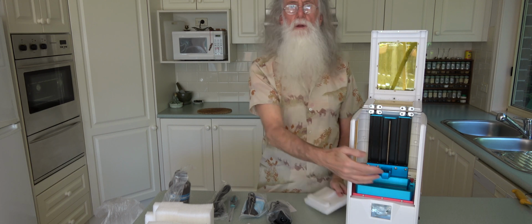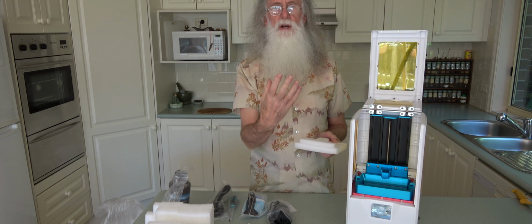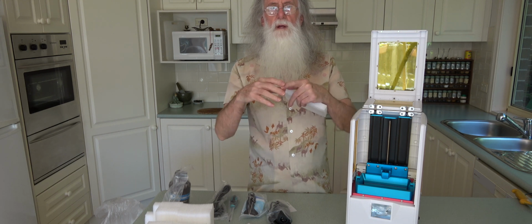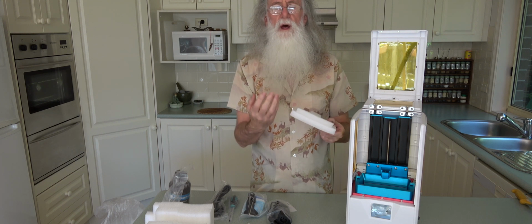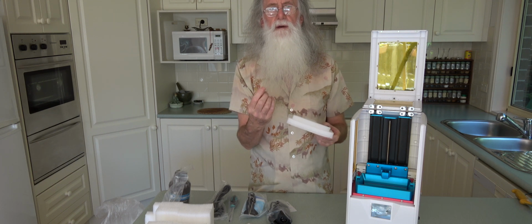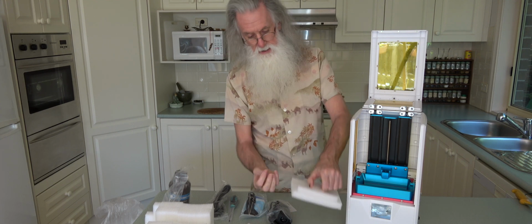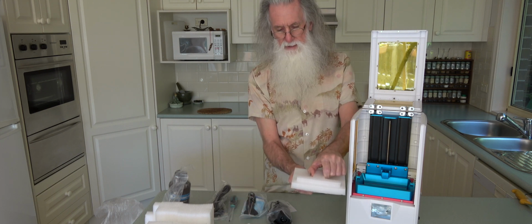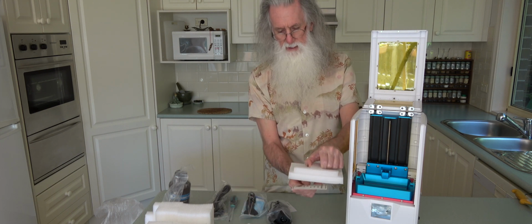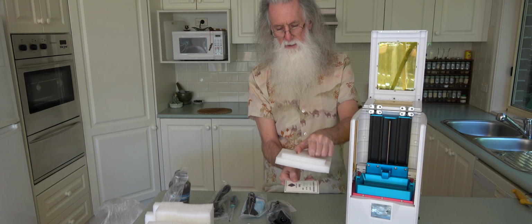it's got a little projector in there, DLP projector, and it sends the image up, the shadow of it, and it's a bit like photographic film, where there's light, it activates the resin. When there's no light, it doesn't activate it. So it's actually printed on the film. That bit of resin is hardened, then it moves up, and that's your layer thickness.